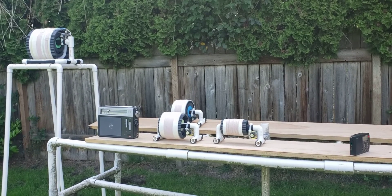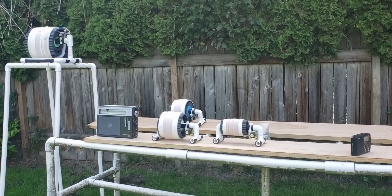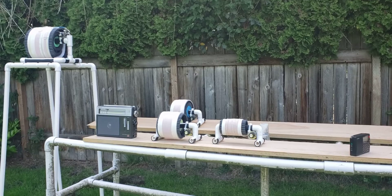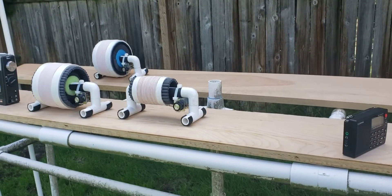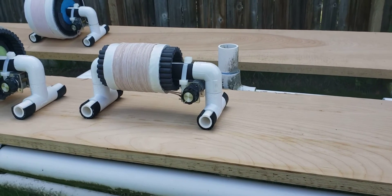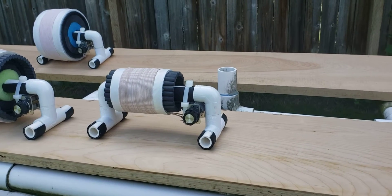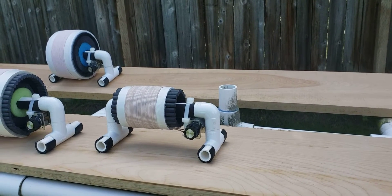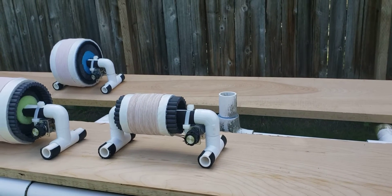The FSL antenna is a tuned loop, similar to an air core box loop, but with much sharper tuning and much more concentrated performance. In my demonstrations, I'm going to be using the smallest of these models — this is the three-inch baby FSL — just to show you the tuning procedures. The very first of the tuning procedures is this: depending upon what the frequency is on the medium wave band, whether it's the low band, high band, or the middle, you preset the variable tuning capacitor.